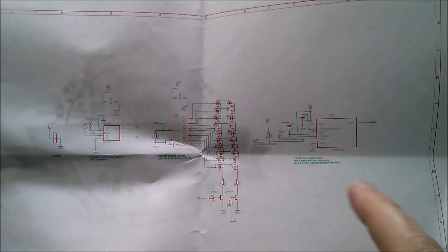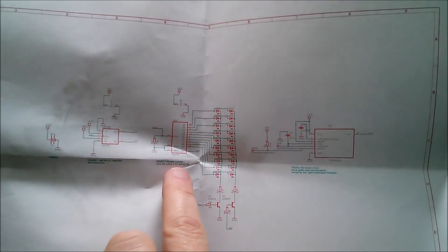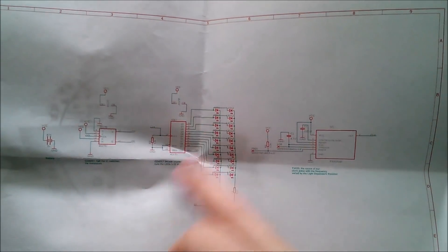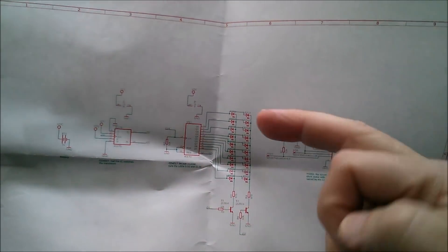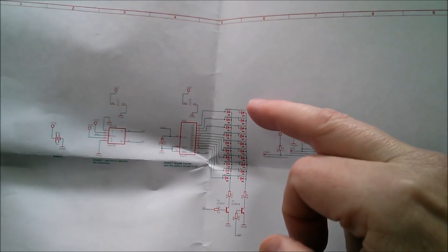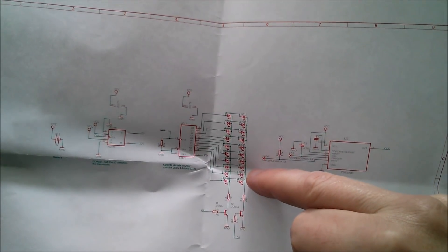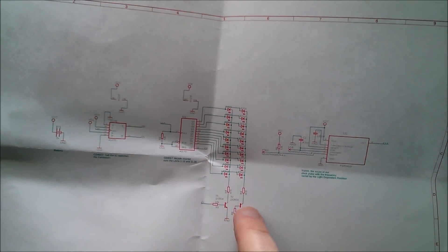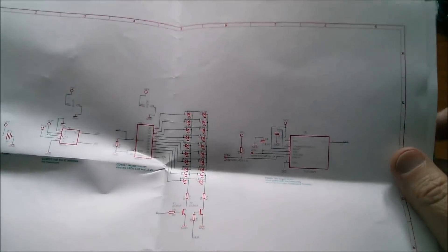This is the circuit diagram. We have a 555 - it's actually a CMOS 555, which makes sense because the two chips on here are also CMOS. We've got a 4017, which is a counter and decoder in one chip, and a 4027 which looks like a JK flip-flop. We've got 10 outputs to 20 LEDs in a 10 by 2 multiplexed matrix. We switch either side of the LED matrix by pulling the cathodes to ground through an NPN transistor with a 10k resistor on the base, and a 3-volt CR2032 battery.